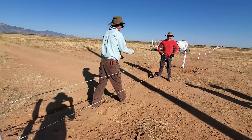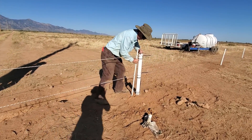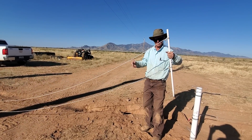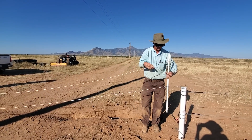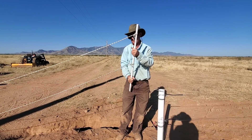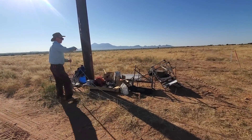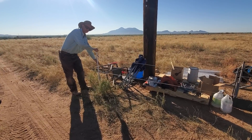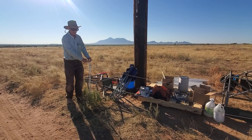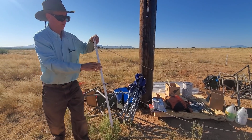Now we've got the gate in, let's see how it works. We've got a truck coming or the cows need to come through here. When you open this up, that's hot — it's the only way to work. If you hook on cold and open this thing up, there's no way to make it hot on this end, so your power has to come from the opposite direction. You are working with a hot gate. I just bring it back — we'll have a wire coming this way with a hook where I can set this on the ground. We'll have a post set here with a hook so it just sits there and stays put.